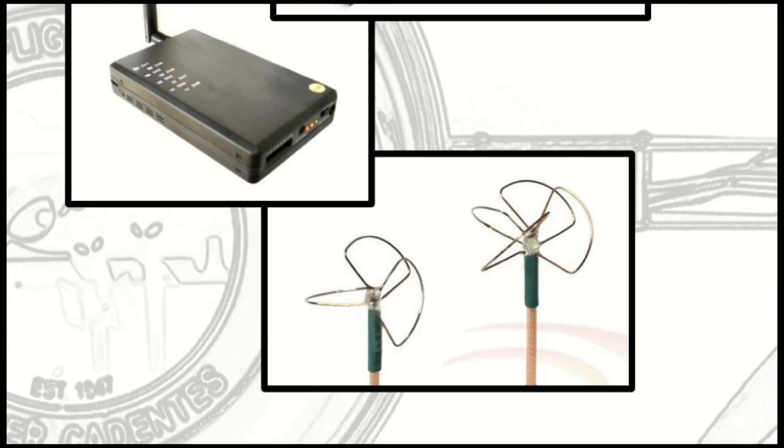And then antennas is where there have been some interesting breakthroughs, and those little bent-up paper clips are, believe it or not, the state of the art. Right now the big thing with antennas with these things is their polarization. A circular polarized antenna doesn't matter which direction the aircraft is going in, it'll receive a good solid signal with very high multipath rejection. Multipath being if the signal gets reflected off a building or some other object, you get echoes in the picture and video loss and therefore control loss.